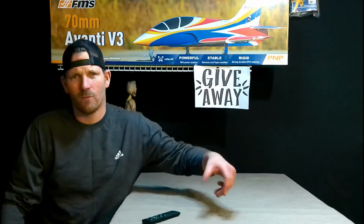One of the ones I didn't test, but I did when I was making sure this worked before I filmed it, was one of them real cheap blue 9-gram servos. You know the ones you see advertised. They're 10 for $4 or something. And that drew 5 times as much as any of them. It was bizarre. I've got a DC power supply that's adjustable for any voltage you want, and it'll hold that volt without dipping down like this battery pack did. When I did full blast on the setting where it went back and forth, it probably went from 5.5 volts down to 2. I mean, there's just no telling what it was taking.